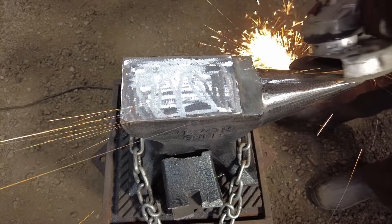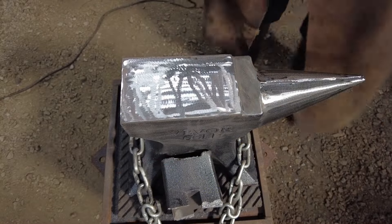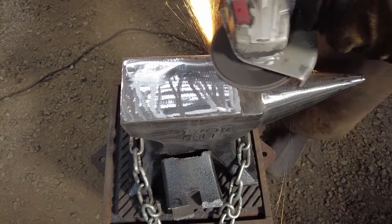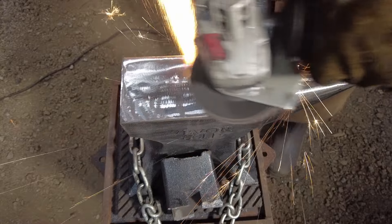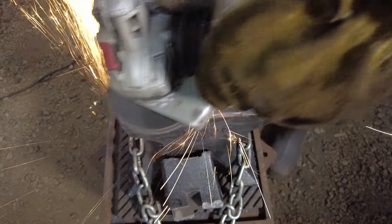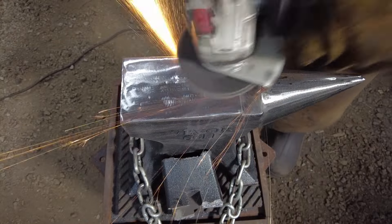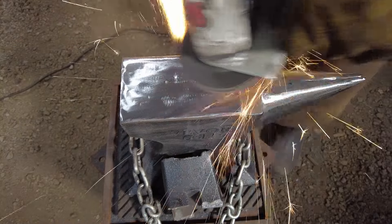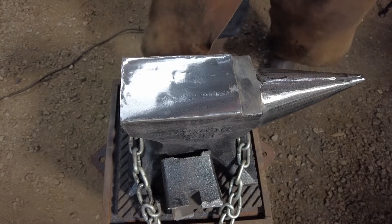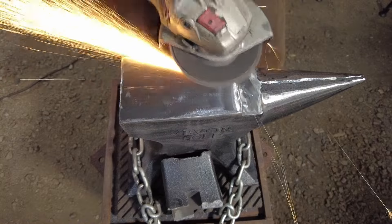After getting that accomplished, I did not mess with the edges yet — that'll be coming up soon when we move to the flap disc. The stone wheel is a little too aggressive on the carving side to dress your edges with; you really only want to dress your anvil edges with a flap disc. So that's what we moved on to next.